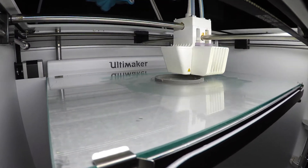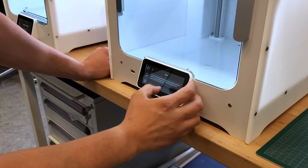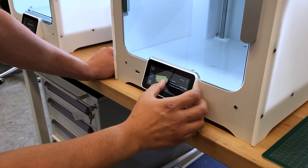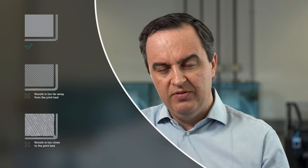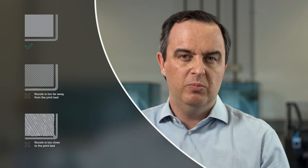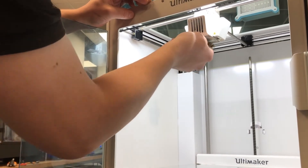Now that G-code is prepared, let's talk about the printing process. The first layer is critical — you need good filling and good adhesion. Make sure the extrusion multiplier is tuned to get enough material purchase on the build surface. When extrusion is tuned high enough for dense parts, some buildup at the nozzle is normal and expected — we want full density. However, too much buildup can cause parts to crumble off and block things, so balance is needed. Using a brass brush to keep the nozzle clean before each print is very helpful.